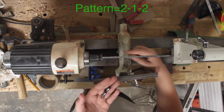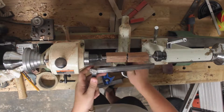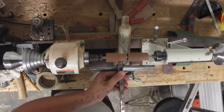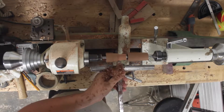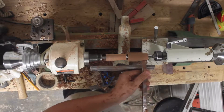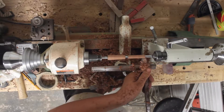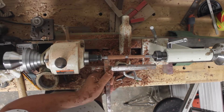Now you want to put on the mandrel and the mandrel saver. For the bushings you want to do a pattern of 2-1-2, which I found is the best thing to do. You can really use almost any tool for turning these — I just found that carbide works the best. I used to use a skew chisel but then I started using scrapers, and then I made these carbide tools and found they are the easiest to use. When you're turning you want to turn at the highest speed your lathe can go — for me that's 3600 RPM. You want the highest speed because it creates less tear-out and it's just easier to turn.